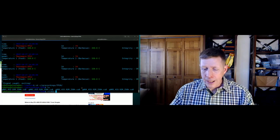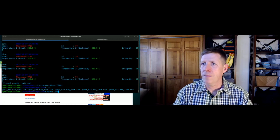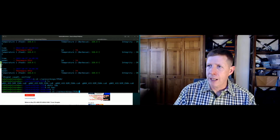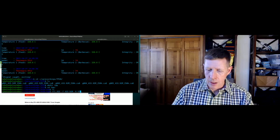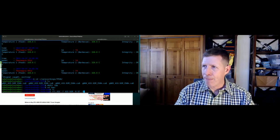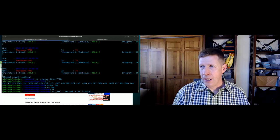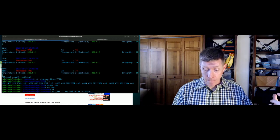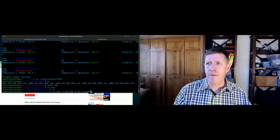And so you can store these natively. If I do mkdir temp, cd temp, ls. Okay, so I can run my RTL-433 again. So rtl_433, frequency 433.92, looking for code 97, which is my thermostat, dash capital S known. Okay. So what that will do is, I'll show you. Anytime it grabs a data burst and it recognizes the data burst and is able to decode that data burst, it will save a recording of it.